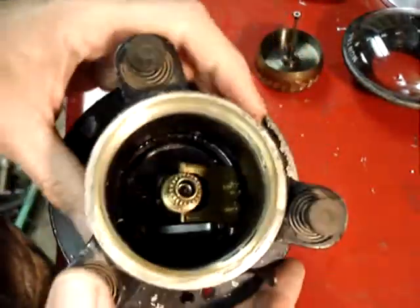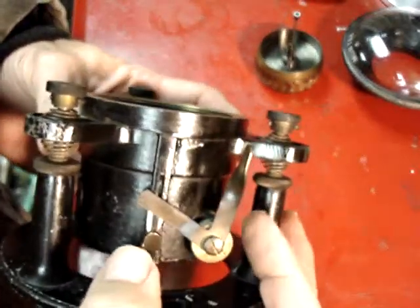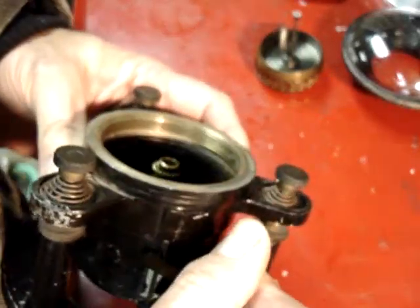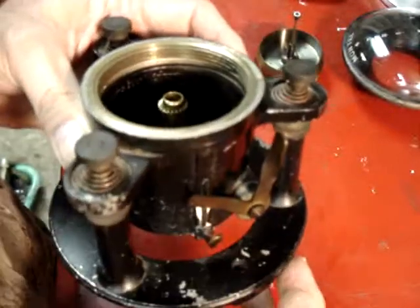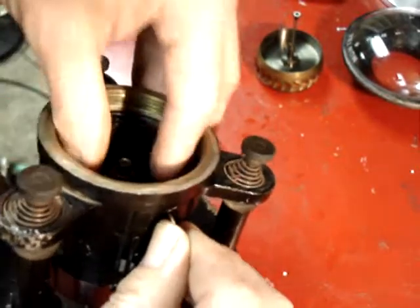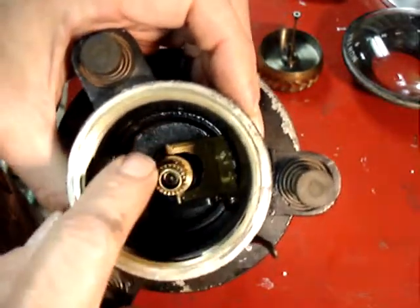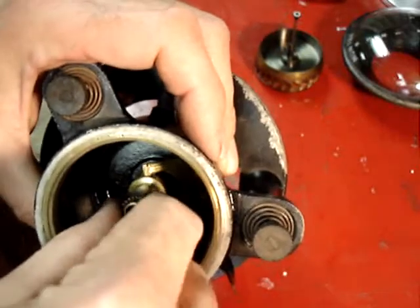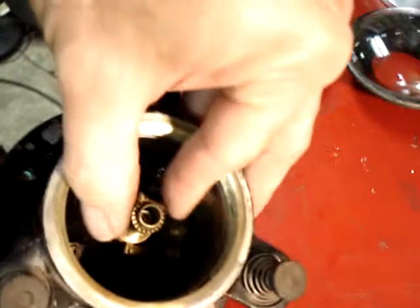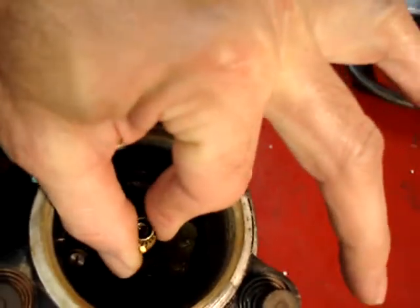Now when you look down on the inside of the thing, you can see on the side it has this caging lever and the caging lever release. You press the release and it drops down. Then you push the release and this pops out, and then you push it back in to release the thing — it's a little sticky but you can make it work. On the outside perimeter of this external boss, it has a helical machined groove on the inside, and when you press the release, this thing actually turns — you can see it turns as it goes down.